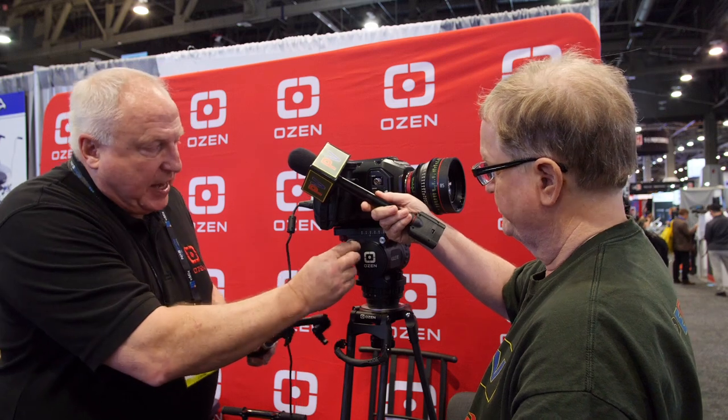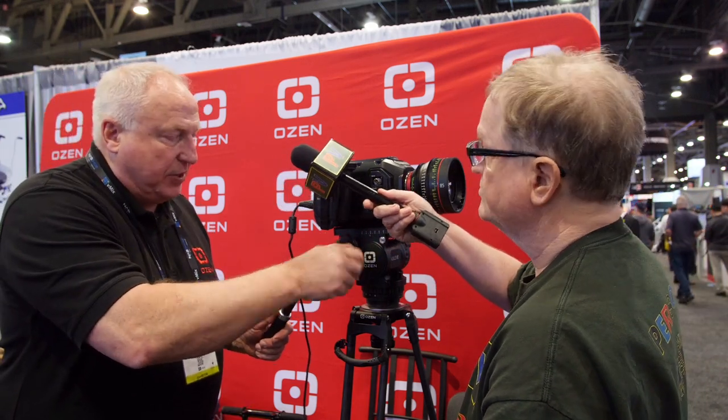And with some of our competitors, the rosette is cut into the casting. When you wear that out, the fluid head is done. But all of our heads, even our smallest heads, right down to our Agile 6, have replaceable rosettes. Oh, that's cool. I like that idea. Of course, illuminated bubble balance. It's all incrementally adjustable counterbalance, and true fluid drag with damping grease, not lubricated friction.